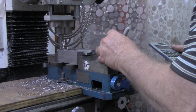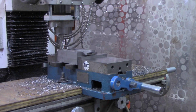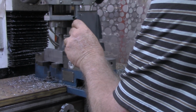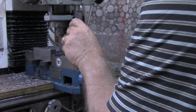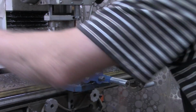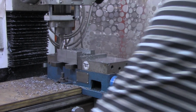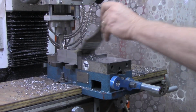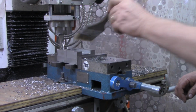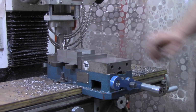And we moved 350, so 376 is where we want to set our DRO, to 376. Now we'll go 376 on the other side of zero. That's it, the main slot has come out. We'll come back after we get the 60 degree cut out there and put a little relief in the center. But I want to leave that flat for now to measure the dovetail with the pins on. So I'm going to get set up with the dovetail cutter, and we'll be back in a moment.